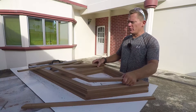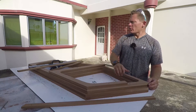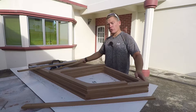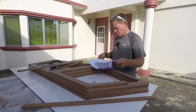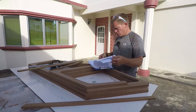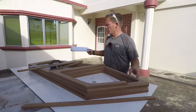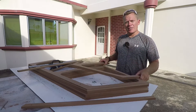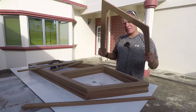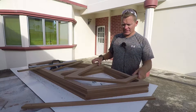That is layer 3 forward section done. If you're wondering why it's cut short here, it's because I think a 12mm piece — let me just check the plans. There it is, it is 12mm, so we then have to put a 12mm slot in there. But for the time being I need another one of these, and I'm going to put it on another piece of 18mm MDF and just use the router to cut it out.